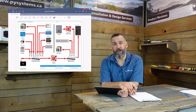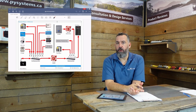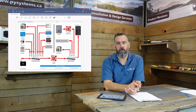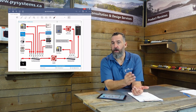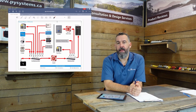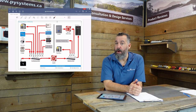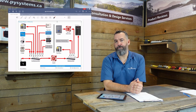My windlass is connected pretty close to the batteries, but it is on the switched distribution side. Now why switched and not unswitched? The reason is that with a flick of a switch, you need as a boater to know that you're disconnecting pretty much all loads on your boat — all loads have to be disconnected almost in a heartbeat. There are going to be some loads connected to your unswitched distribution, like a bilge pump, carbon monoxide detector, radio memory — those things are always on. But when you turn that switch off, a windlass should go off too. So you want to install the windlass to the switched distribution, and you want those cable lengths to be as short as possible. Most of the time, because the DC panel is not powered with the right gauge cable to power a windlass, you're going to want to bring the wire as close to the battery as possible and have it on the switched distribution of your batteries. It's a great question.